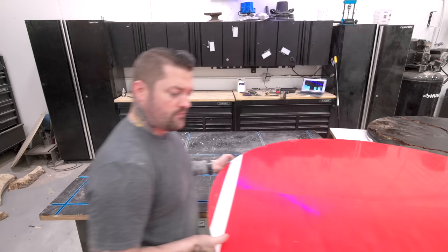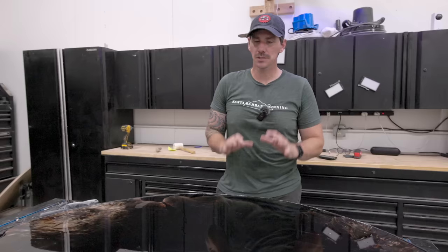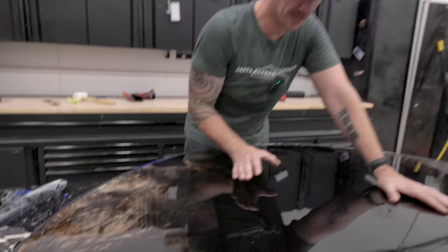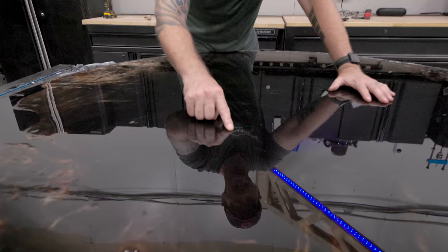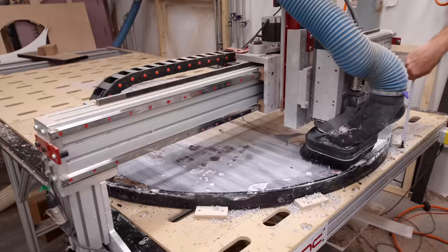I expected these last few pours of black epoxy to go smoothly, so I didn't even turn on the camera — and naturally, it all went to hell. What happened was I thought I had this slab perfectly leveled, but something got off. I was filling up more of the middle and it wasn't getting into the ends evenly. As I tried to even up the outer pieces, epoxy flowed up and over the center, which is a problem because I've got to do the gold leaf inlay on those cracks. I ended up doing a complete flood coat — and now I've got to take it back to the CNC, flatten everything, which is going to take off that beautiful dye job. I'm going almost back to zero.